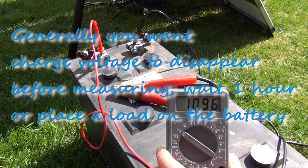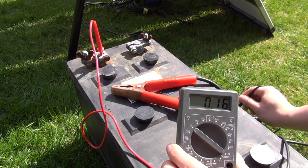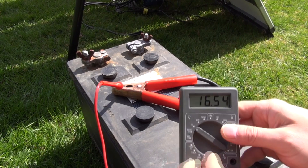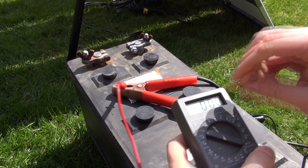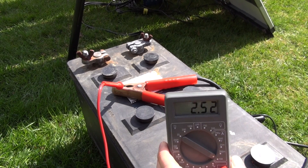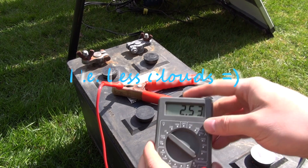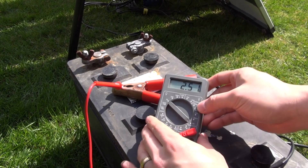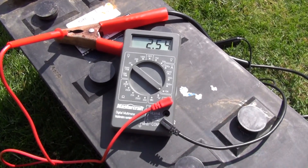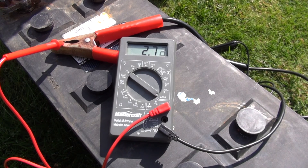It is slowly rising — I'm in luck! I'm curious if we can show a better amperage rating now that the sun is really peaking out. Still 2.53 amps. I know sometimes you can get 3 amps, but definitely when summer comes around and it's more intense it'll get better. You need to make sure you position your solar panel in the right direction. Let's see what happens if we move it a little — see, we've jumped up a bit. Position it right toward the sun and it makes a difference.